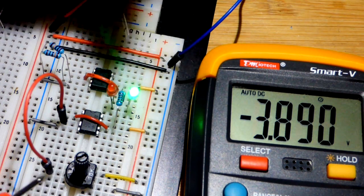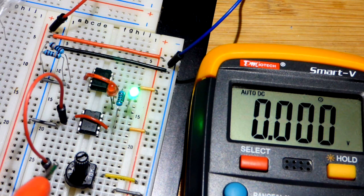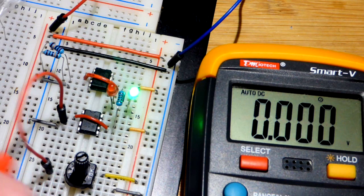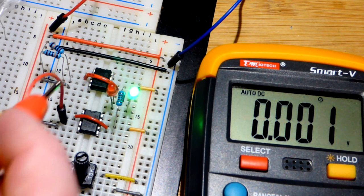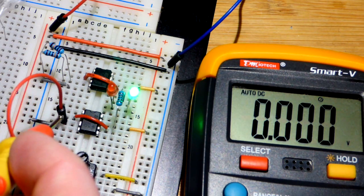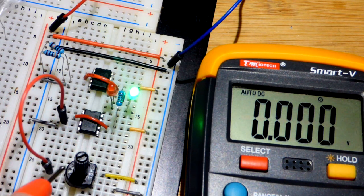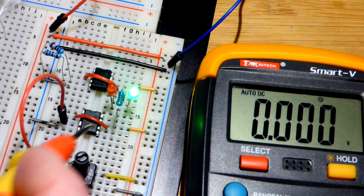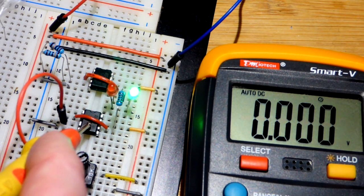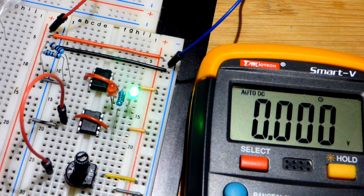The way that we have this wired up that I showed you, we get the same voltage at the output. There are a few complications, but it's relatively close to the output we set with the trim pot. And we don't have to give any current out of the trim pot, just a very, very small trickle, an insignificant amount really. And so it doesn't alter the voltage we're getting out of the trim pot. The voltage that we set it to stays pretty true. And so it doesn't matter what the load is, as long as the 741 op amp can handle it and it doesn't exceed the range that it can output.